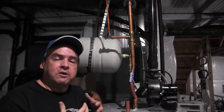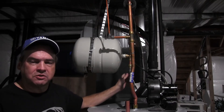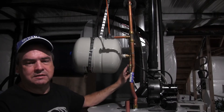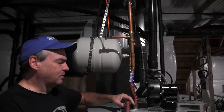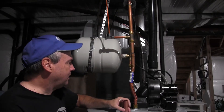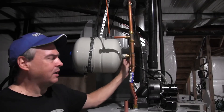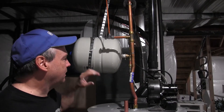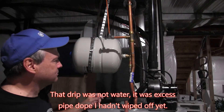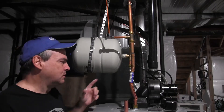If you're going to do it this way, here are the supplies you'll need from the hardware store. In total it was about $85. That includes the flex hose at $12 — it has a threaded nut on one side for the inlet side of the tank and a SharkBite side on the other, and it's three-quarter inch. Some three-quarter inch copper tubing at $9 for the rod. The SharkBite T-fitting with three-quarter inch on the straight line sides and a three-quarter inch threaded female on the T. The expansion tank at about $50, the strap at about $3, and a plug at about $3. All in all, about $85 in supplies.